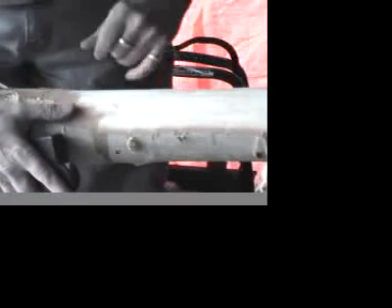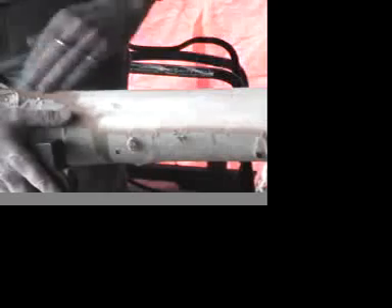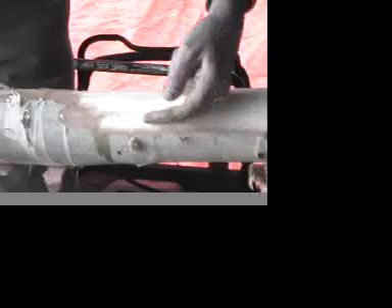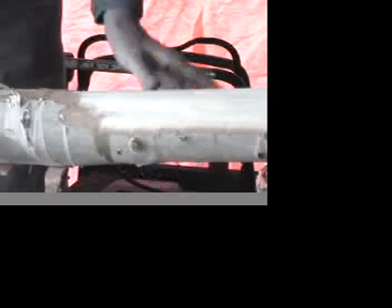In that time I've done a section about 30 centimeters long and about a quarter of the diameter around the edge of the tree. That little white spot there is where I've actually cut the wood slightly, but because it's green and the axe is sharp, I can just shear that away. That will leave me with the clear white wood underneath, ready for my next step.